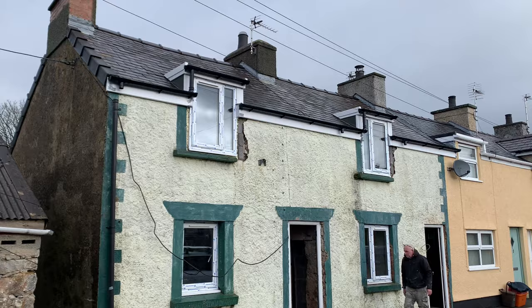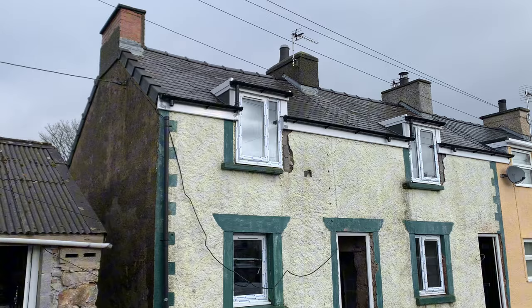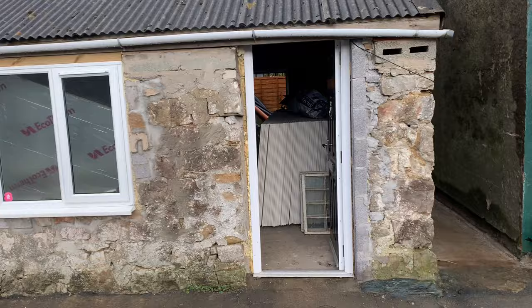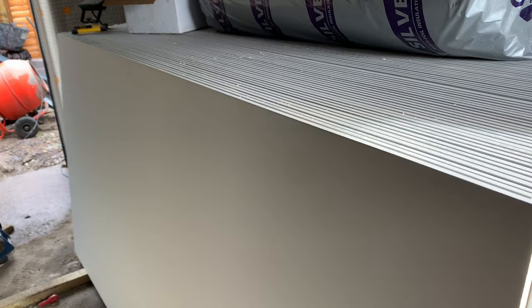Day two - got quite a bit done yesterday. I'm just going to show you what it looks like from the front. Windows and doors are in situ - they've just took this one off as it wasn't sitting quite right and was quite drafty, so that'll be sorted. Then just on with these plasterboards - carrying up the insulated and just the normal plasterboard. Every one of these is going to go on the exterior walls, and then these will be on the roof and interior.